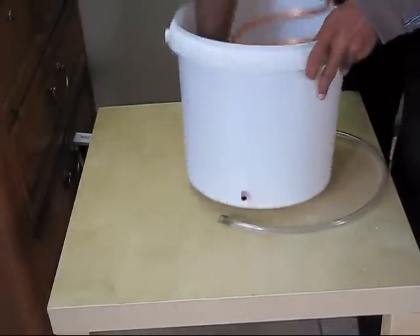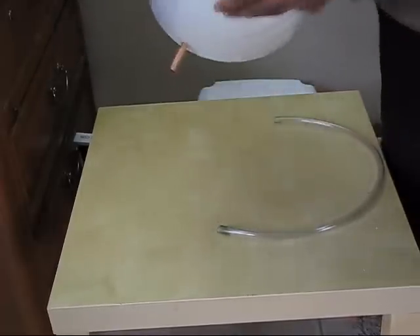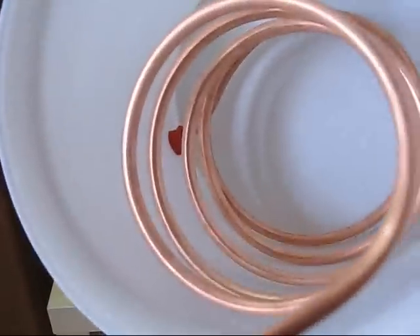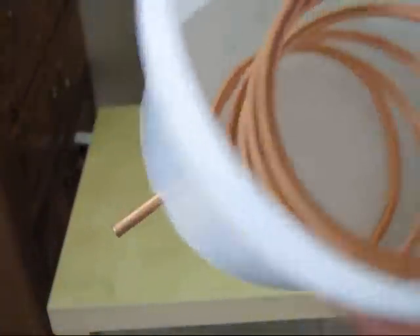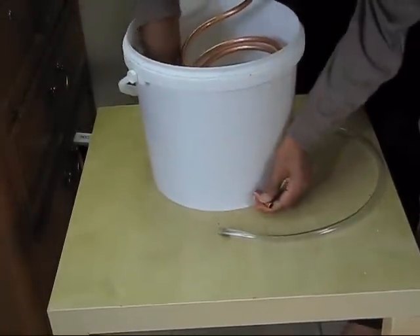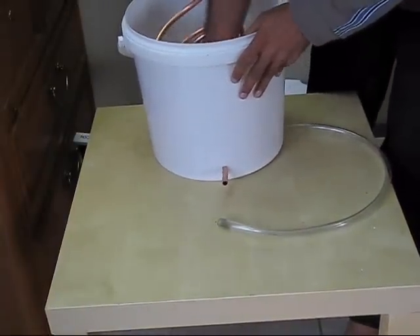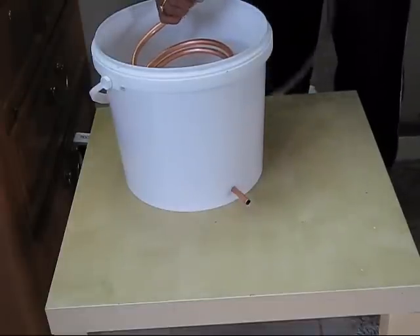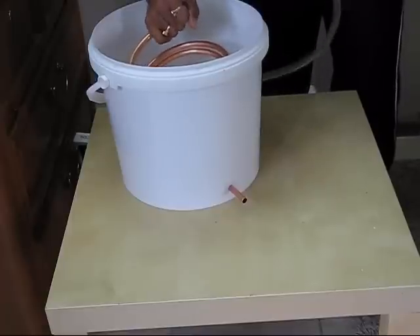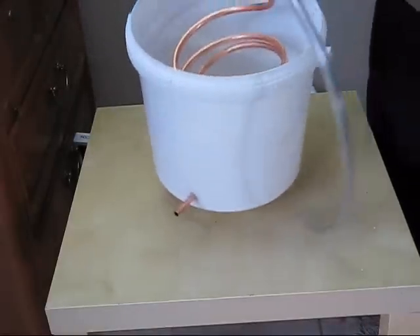You can see it came out. Then I put inside a rubber stopper — you can see, easily like this. This will prevent water from coming out. If needed I can add one more o-ring here in this container. The coil is almost ready, just bent a little bit more. On this side I have a plastic rubber tube. I need to tighten this again and now this is ready as a condenser.